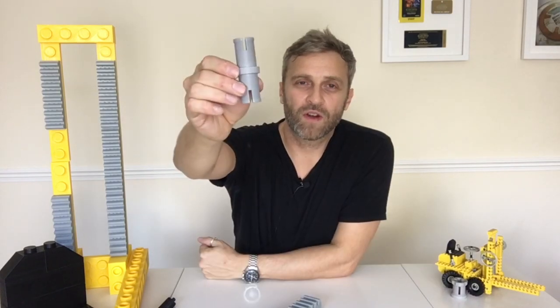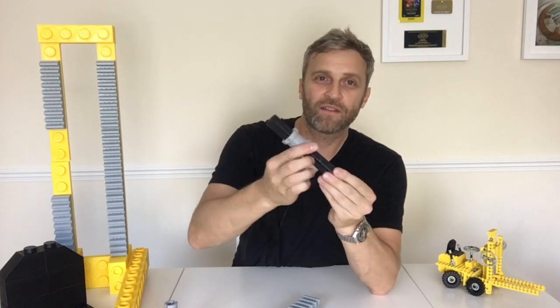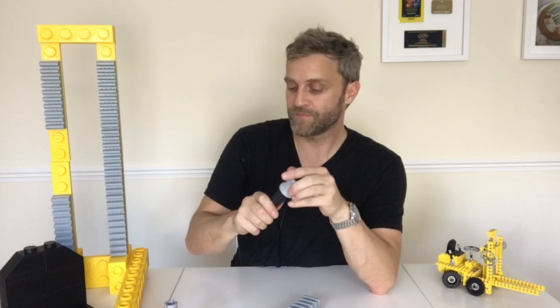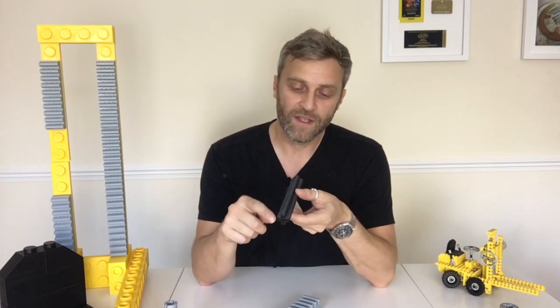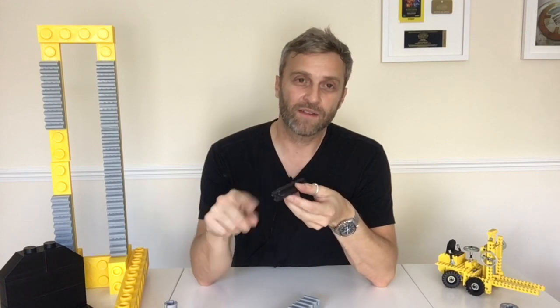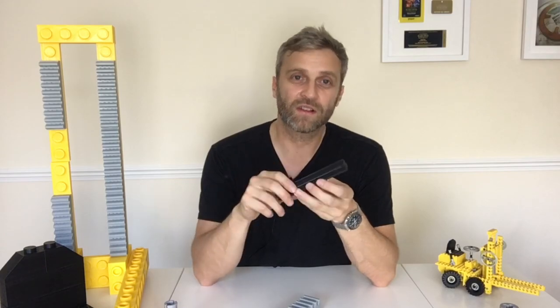The screw lines are two halves of the pin up, and then they're acetone welded as well. All of these grey bits are ABS. So that fits a bit nicer. Again, it's a little bit variable, but it is something you have to watch, because some of these have come out really tight and I've then had to do some post-processing on them. I basically take a knife along the edges and scrape them back a little bit, very carefully, just deburring them effectively, or sanding back the edges just slightly.